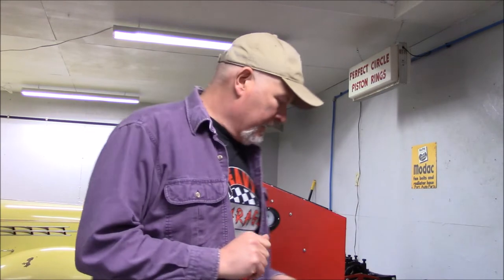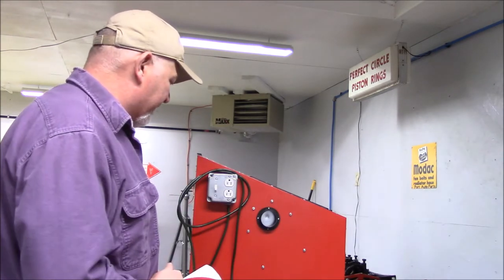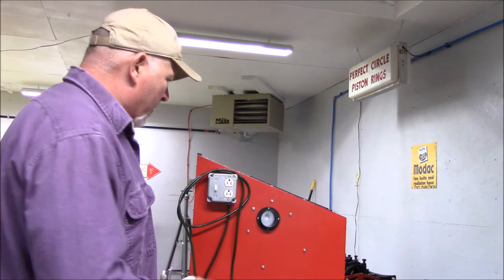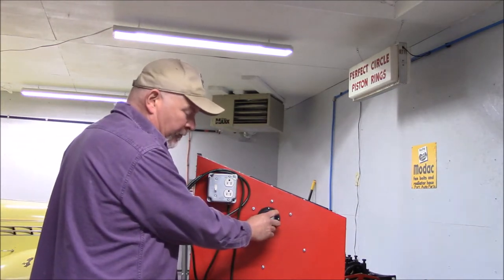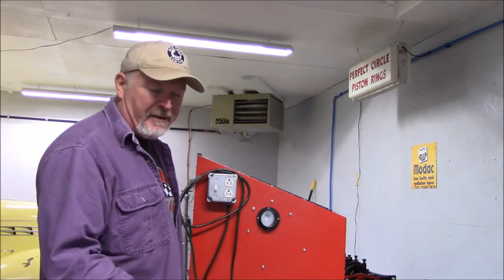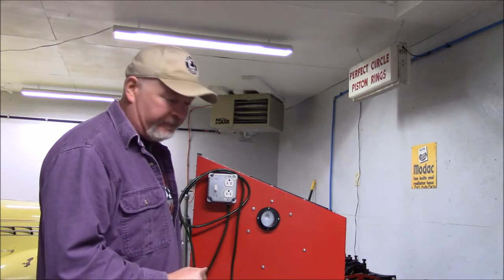Now, today's little video, we're going to have a review. As you can see here, I got my blast cabinet, and I'm sure some of you have seen it in the background on videos in the past. One thing is when you use a blast cabinet, you want to hook up to a shop vac to vacuum away all the dust from the cabinet. Problem is, it clogs up the vacuum's filter.